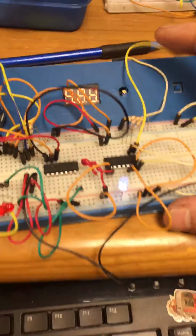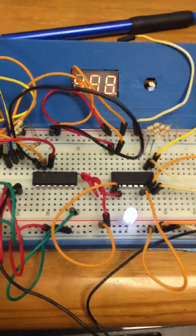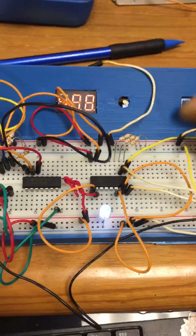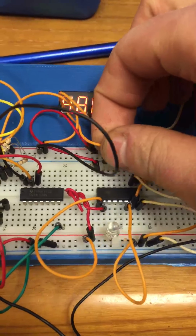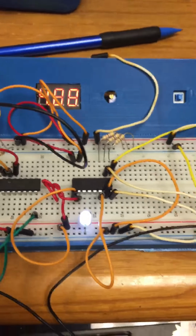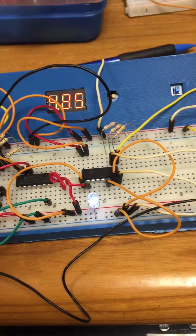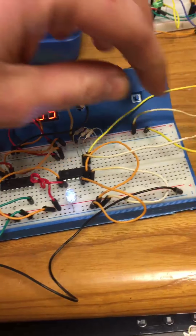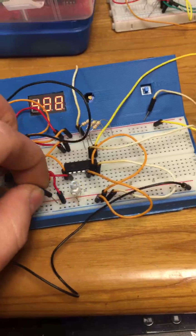But so right now I still have that pin 13 unplugged, and then with this one connected, which should be S1 by the diagram given, that would be selecting channel input 1 on the diagram given. So there we have S0 and S1 both connected, which would be selecting input 3, which, as you see, when I unplug, loses power, and if I unplug this guy, we will go to input 2.